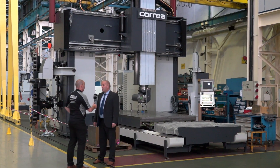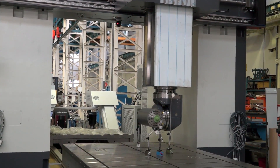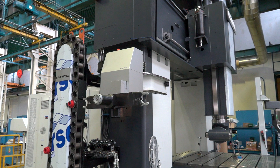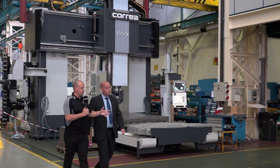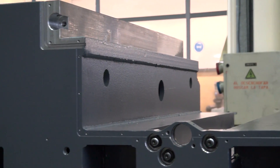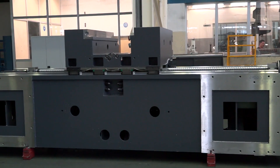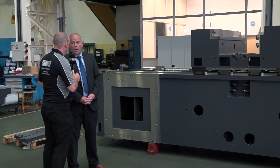So what machine have we got here, Ian? This is a Fox machine — it's a double column bridge type machine. At the moment it's in assembly and by the looks of it we're clocking in the head. How big does the Fox range go? This machine in this configuration goes up to eight metres in the X axis, 2.5 in the Y axis and 1.5 in the Z. You can have head changes, and we go up to nine heads on this model. You can see the gantry with the saddle on top, a huge ball screw with four supports, and oversized linear ways. Everything is assembled at this plant.